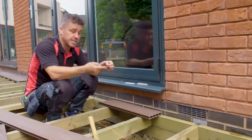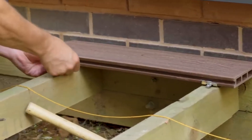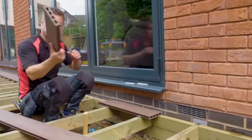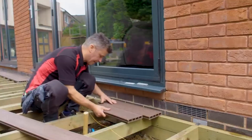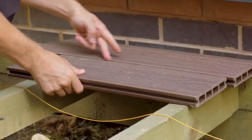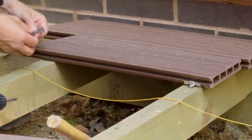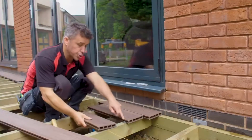This front edge here, you take your second clip — it's a kind of double-ended one. It's pushed in; sometimes you can push these in by hand, sometimes you might have to give them a knock with a rubber mallet. They get fitted again on every joist, 350 millimetres apart. Your second plank is then screwed down here to hold that first plank in place, and your second plank simply clips into position. A gentle tap with the rubber mallet, leaving you the perfect expansion gap, as the manufacturers recommend. The same applies to the rest of the boards — push your clip in, a gentle knock if needed, and then the third plank will be in position, screwed down.